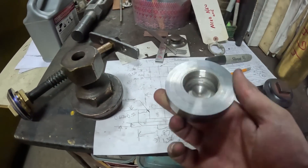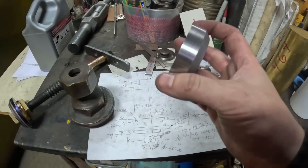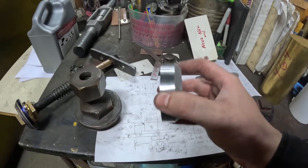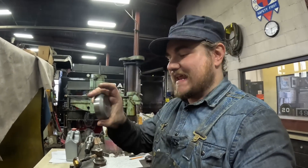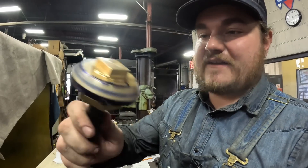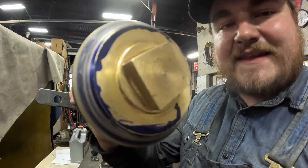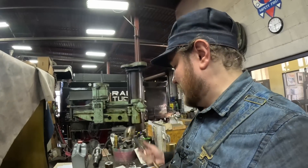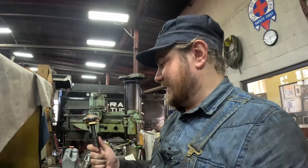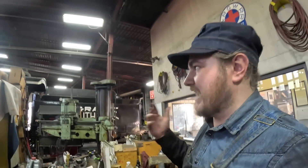I had to go through and make this tool — I'm not really the world's best machinist, I'm an apprentice learning these things. It took me a day to make this; it was a lot of work. And then I had to spend about half a day lapping it into the actual body of the valve. Then, because we corrected the geometry and the seat in the locomotive and needed to fix the threads, I had to do it all over again in bronze. I'm actually midway through lapping it now. I've blue dye-checked it and I'm getting pretty close to a good seat all the way around, but I still have more lapping to go — working on this all day today after working on it a fair bit on Saturday. So we're going to be four or five days into this repair that was an extra repair on the annual inspection.